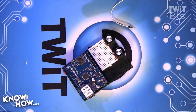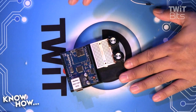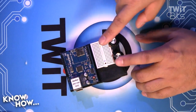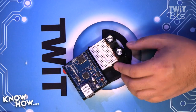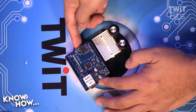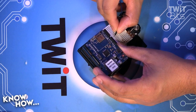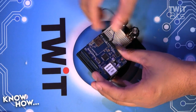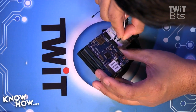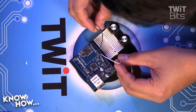First we're going to do a little wiring. This first example is pulled almost directly from the example library on the Arduino sketch — it's one of the ones provided when you install Arduino. We need to power up these two potentiometers, so I'm pulling 5 volts and ground — ground pin there, 5 volts here.